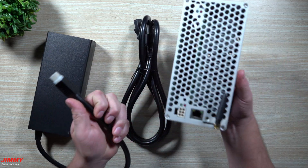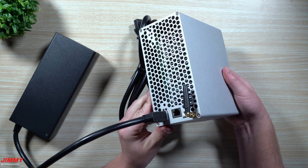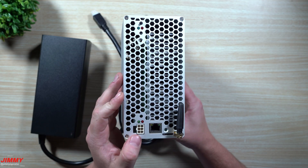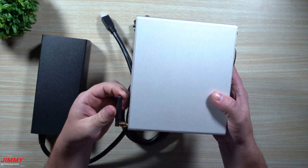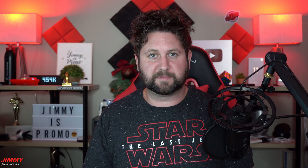Taking a quick look at the box, it looks the same as any other small GoldShell ASIC miner. This thing is tiny — it has a couple of fans, a button, a LAN port, and a small little antenna which gives you Wi-Fi capability. I'm going to show you how to get it connected via Ethernet as well as Wi-Fi, or both at the same time.